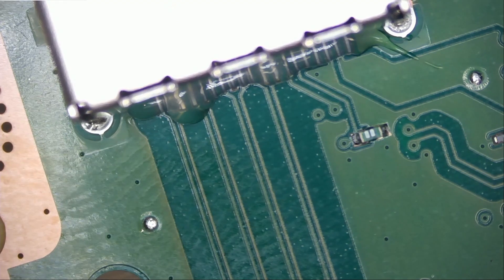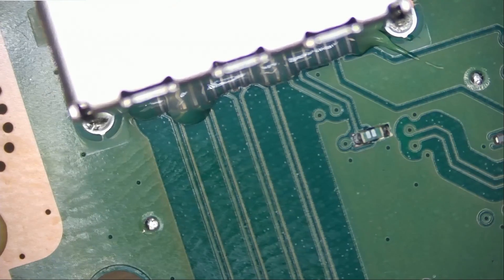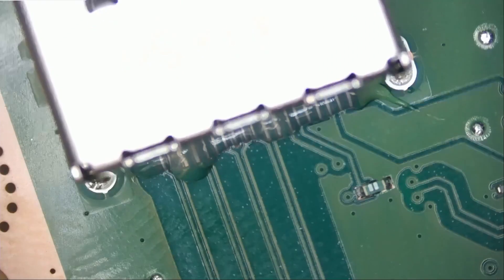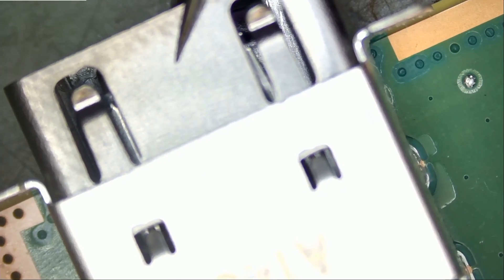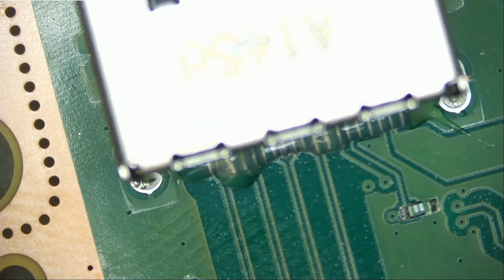The next thing on the list is low melt solder. Right now if we apply heat onto the board to remove that connector, it's going to take a lot of heat. The board is thick and will have to absorb all the heat until it reaches the melting temperature of solder. Low melt solder melts at a very low temperature when mixed with unleaded solder already on the board. Say low melt melts at 120 degrees Celsius and unleaded melts at 240 — if you mix the two and take the average, that's how much heat it will take. That's why we use low melt solder.